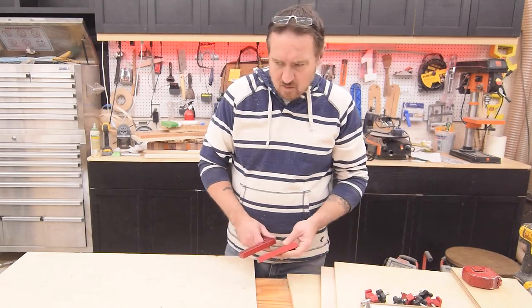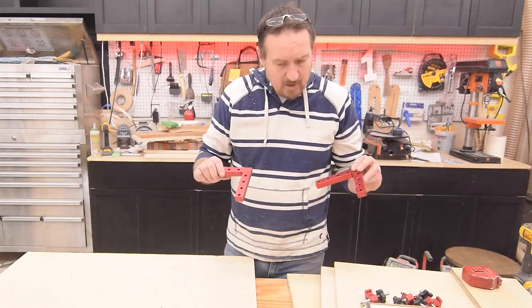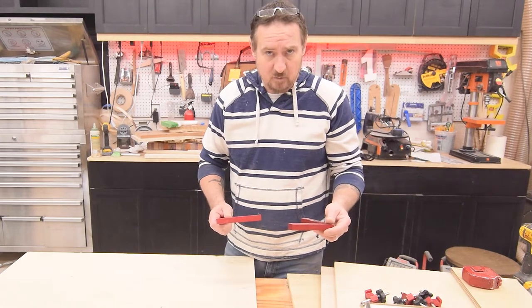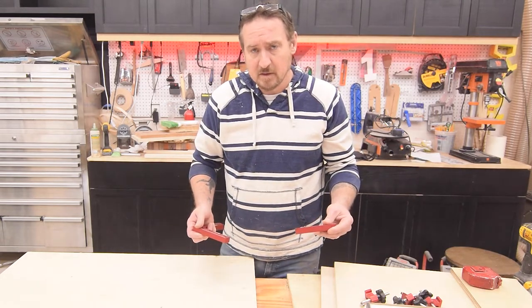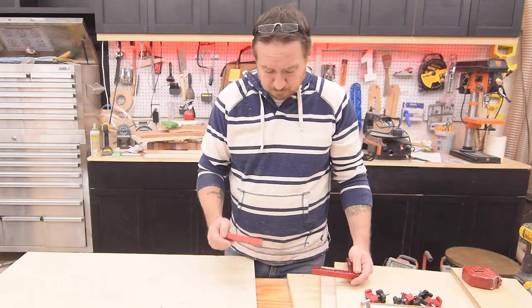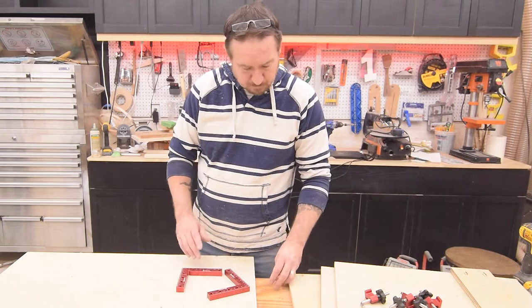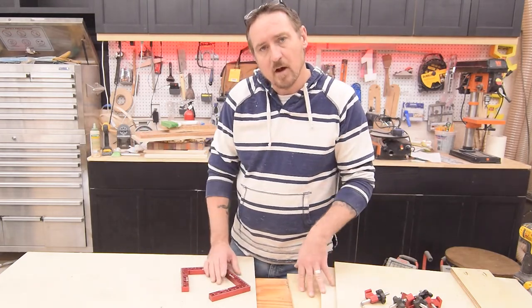When you're working alone, it really pays to have a set of right angle clamps. I know what you're thinking — these are red so they must be that really expensive brand, but they're not. These are a knockoff made by Hardel. They're not designed to apply pressure — they're really only designed to allow you to position everything. That's what we're going to use them for: positioning. Then I'll use my long bar clamps or a grip clamp to actually apply pressure when I start driving in the pocket hole screws.